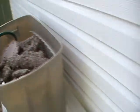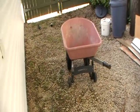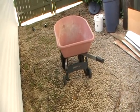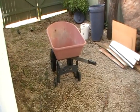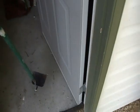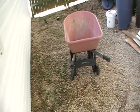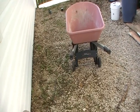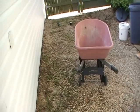While the rocks get back to their bath, I'll explain how I mixed everything. I put my parts in and fill the wheelbarrow to about a third of the way full, because if you put too much in it gets really hard to mix. First, put in your dry mix and mix it up — I use a garden hoe, which works great for mixing cement. Then put in your water and mix until you get a good, slightly dry consistency. After that, make your molds and shape your rocks.